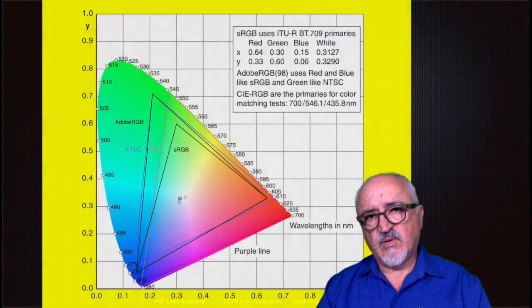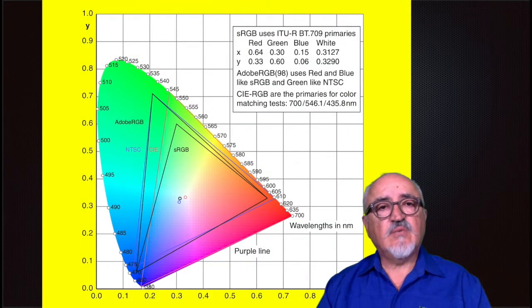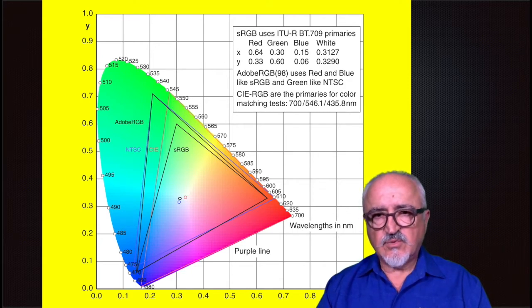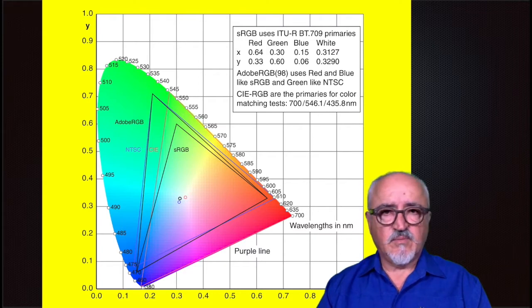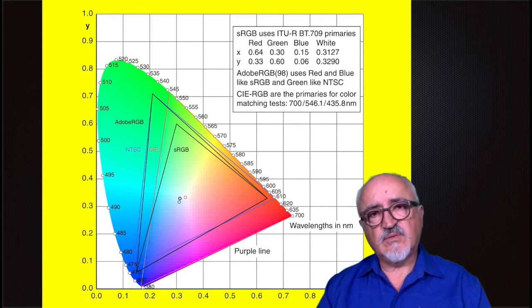One of many functions in processing the RGB components in a color camera is white balancing. This is simply an algorithm which corrects the white portions of a scene to appear white to human perception, irrespective of the color temperature of the light source. In the video lecture about color temperatures, I have already explained more about that, so refer to that lecture if you are interested in more details.